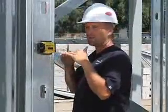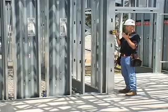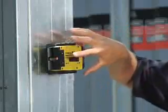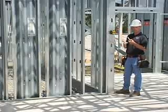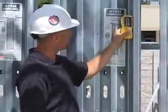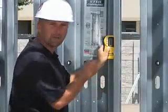That horizontal beam serves as a benchmark — close by I can see it, it's pretty bright. But because it's an open job site, when I go to find a benchmark around the room, I may need to use my receiver. We put pulse line technology into the LAX ProLine, so with the receiver, even if I'm 100 feet away and can't see the line, the receiver will pick up exactly where that laser is. I'll turn the receiver on, and as I move it in, you'll hear an even tone when I hit zero. That means I'm lined up — I'll make my mark right there.